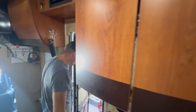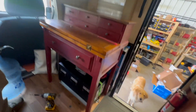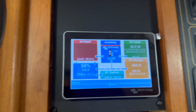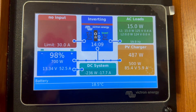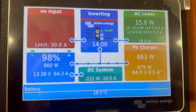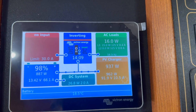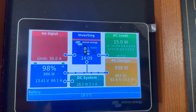JD, I think we're ready. We got it out of the shop and here's what we're getting for solar — about 400 to 500 watts out of 1200. Not great, but it is cloudy. We must be hitting some sun here. Take a look at the DC system — that's negative, that is the alternator. We've got a little bit more sun now: 900 and some watts — that's more like it. Pushing 66 amps into the battery. That's great.